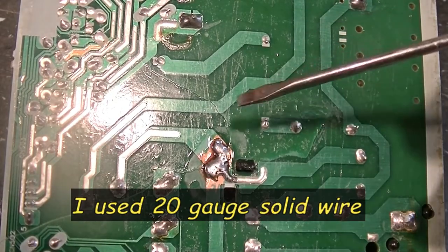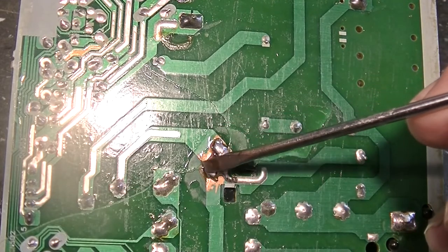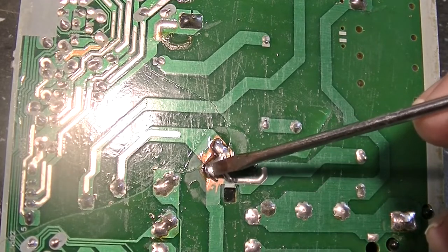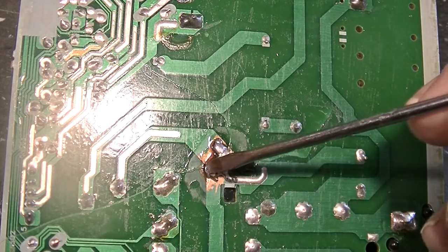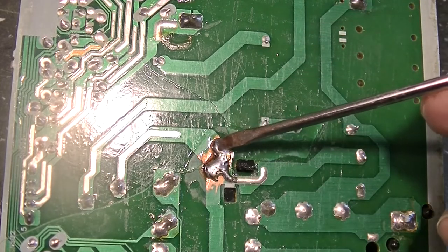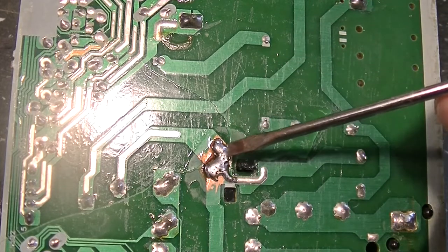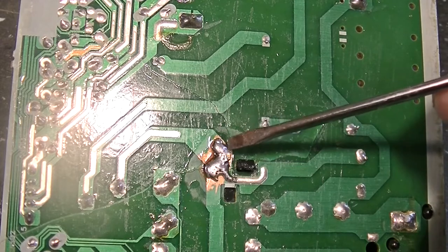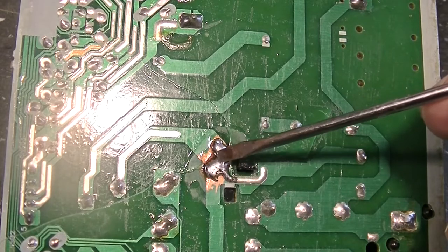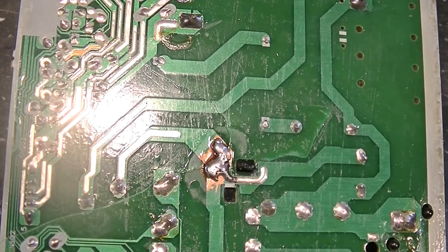As promised, I do have my wire in there now. It's hard to see because I've got it soldered so well, but it basically runs from here to here, down to here. What I did was I tinned the wire itself, then heated up the joint with all the solder in it, and dropped the S-wire onto it with the aid of the hemostats. Once I got it down there and soldered, I held it until it solidified, then went back and filled in places that looked a little light on solder. That's a good, solid connection now.